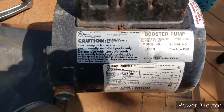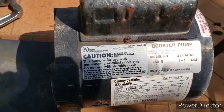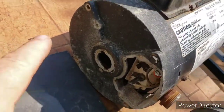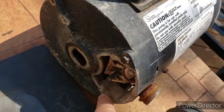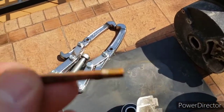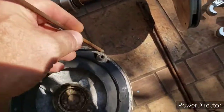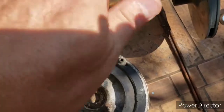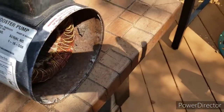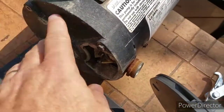Here's my Polaris booster pump that I'm trying to replace the bearings on. To get the motor disassembled you basically have to take out these four perimeter bolts which look like this. Hopefully your threads on the end can come out — those actually screw in to the other side of the motor plate, which would be located on this side. But yeah, what you do is take out those four screws.